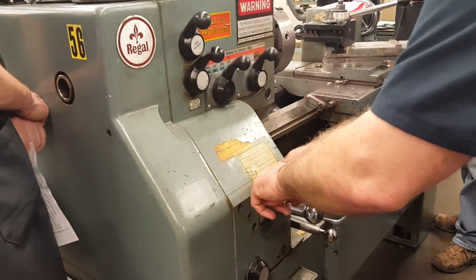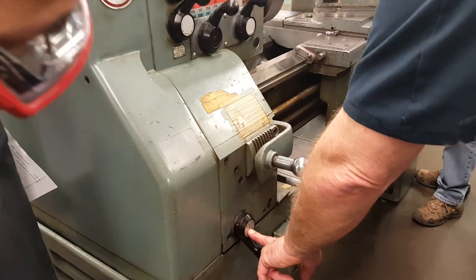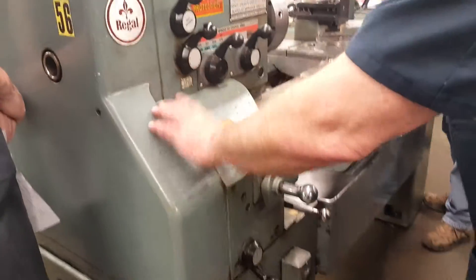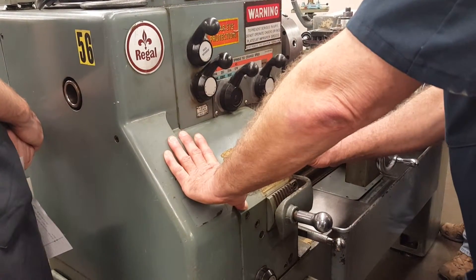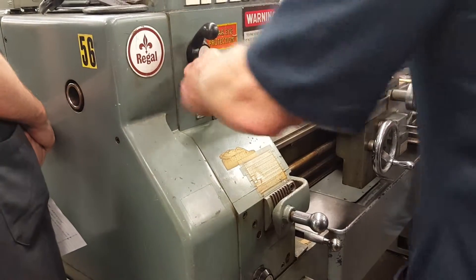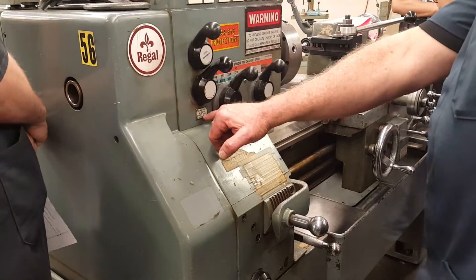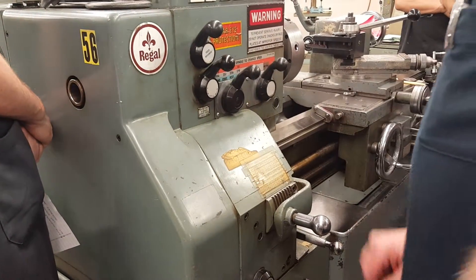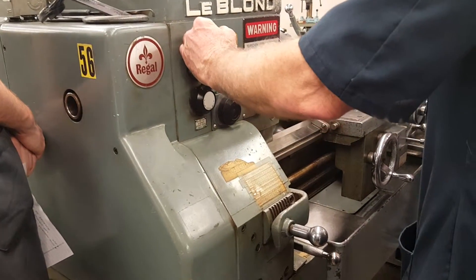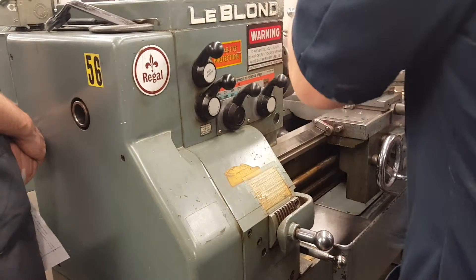The other position where 13 is located is B — that's your gear lever, you've got A, B, C, and B is right in the center. On the other column it's in the E category, so this goes to E; that's F, that's E. There's a plate right here that says do not use E with spindle speeds above 300 — that has to do with the gearing in the machine, it puts a strain on the gears. Always pay attention to any placards you see on the machine.